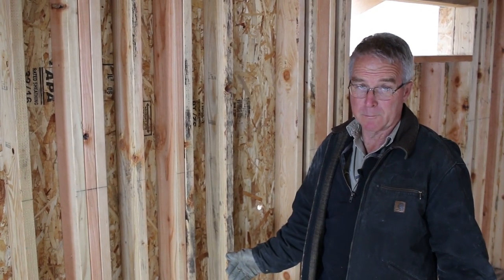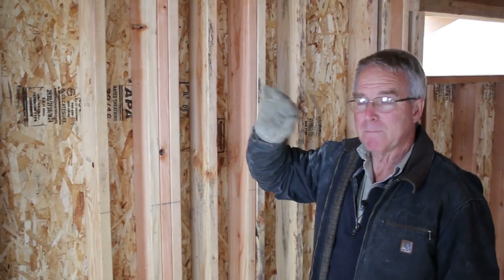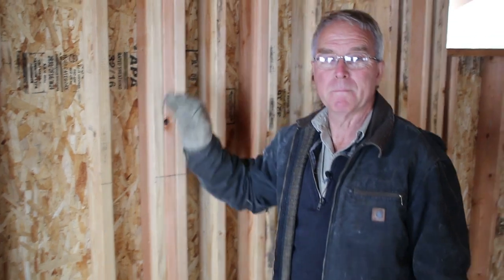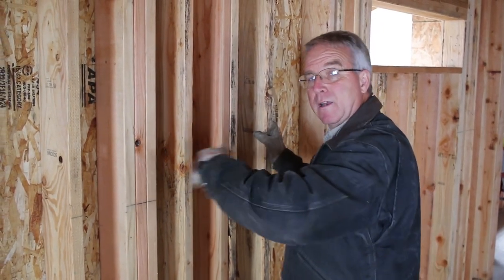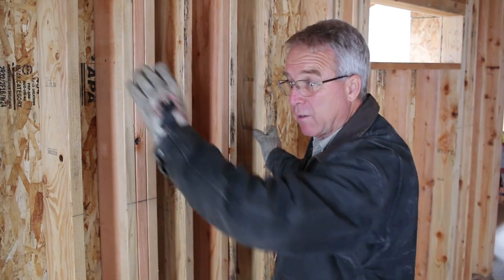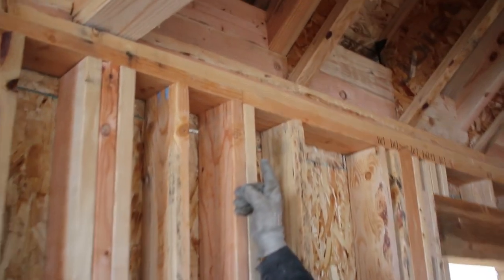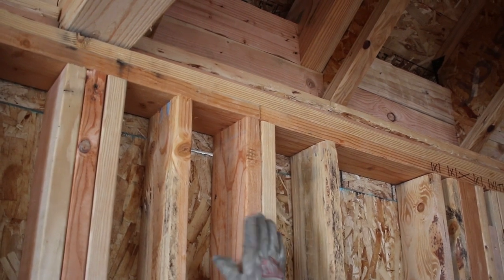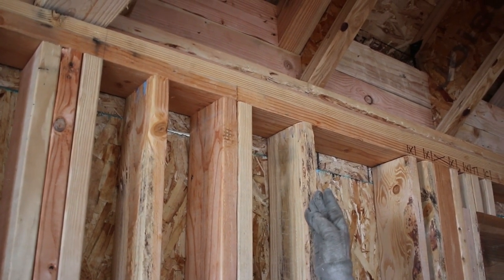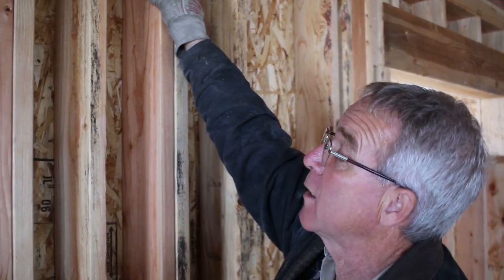Keep in mind that with walls that interrupt the layout, not every stud is going to be 16 inches from an interior wall — it just means that on the outside of the building there will be a stud every 16 inches, which is handy for your sheeting. There are special conditions: right here I came to a break in the plate and it seemed more reasonable to throw in two studs than to shorten the plate to the 16-inch center. I like wood and don't mind using it.